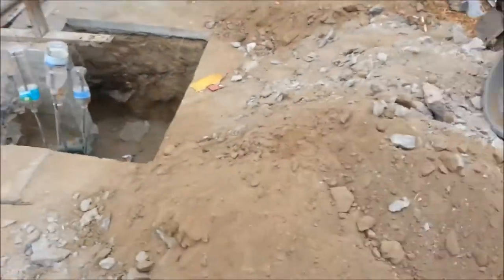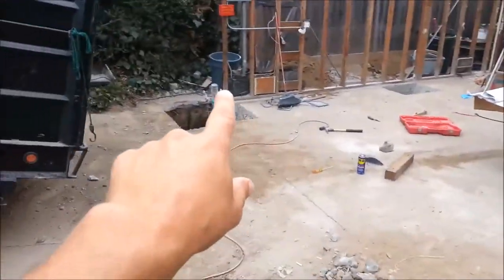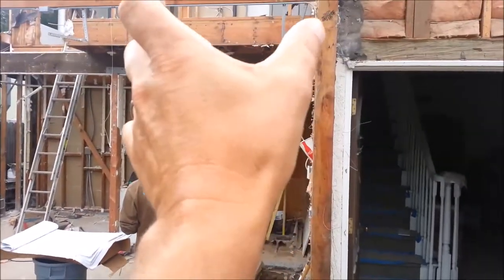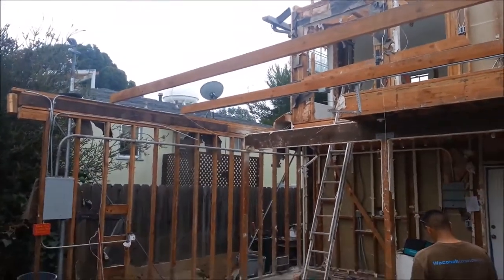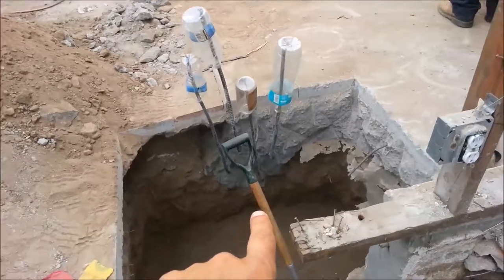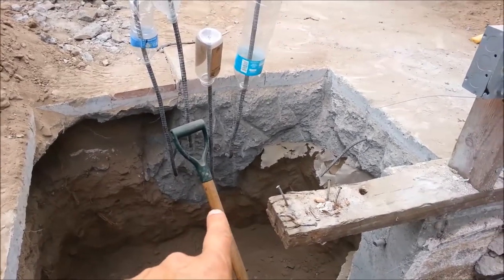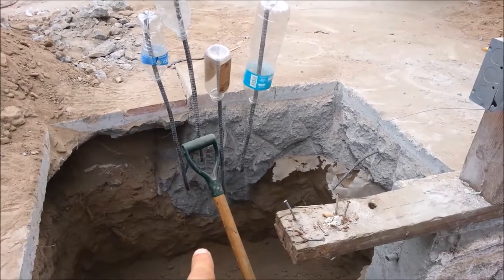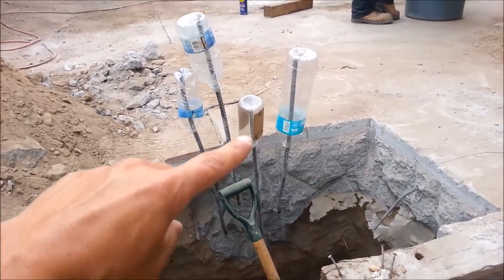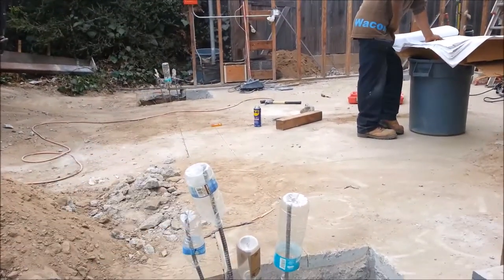We're going to show you what that looks like in the next video when it's done. We have one pad here and another pad over there, really deep, and on top goes a steel frame. These are only 18 inches wide by eight feet tall and they connect to a beam we're going to put all the way across. What connects these two pads so they act together in unison is a grade beam. When we did the demo, there wasn't supposed to be a grade beam here but there is. A grade beam is about one foot wide by 18 or 24 inches deep with rebar and rings around it — four rebars running lengthwise and then rings every 12 or 16 inches — making this a structural beam out of concrete.